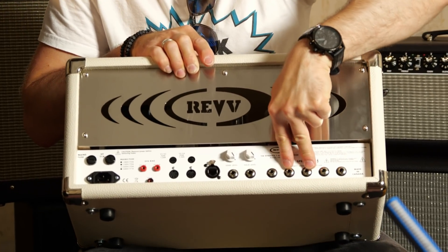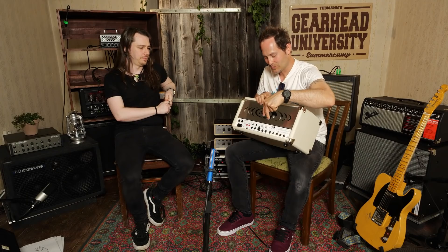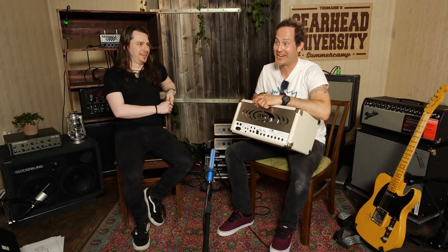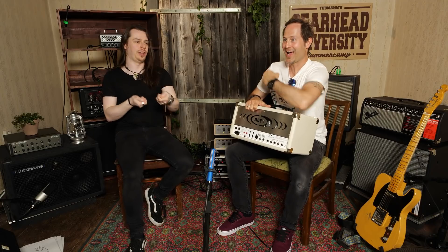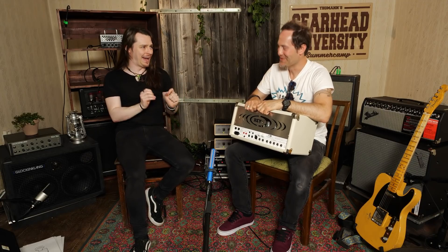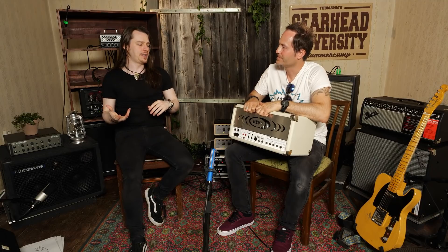Let's stick to 8 ohms because 8 ohm is your safest output. So you have two 8-ohm outputs — why do we have two 8-ohm connections? Can you plug in two 8-ohm cabs? This is the one confusing thing about amplifiers — you would think logically that if you have two 8-ohm connections, you could just plug in two 8-ohm cabinets and you'd be fine. And that's a very bad idea. This comes down to series wiring and parallel wiring, and this can be done both at the amplifier level and within the speaker cabinets themselves.